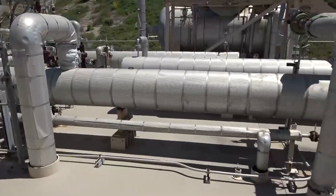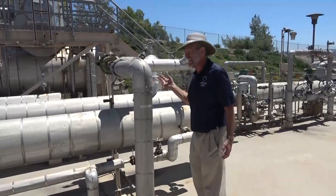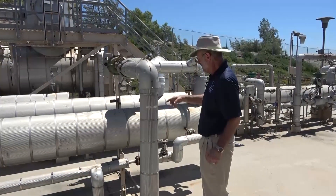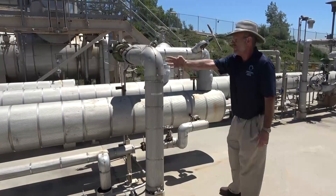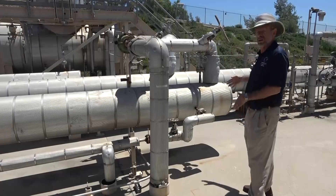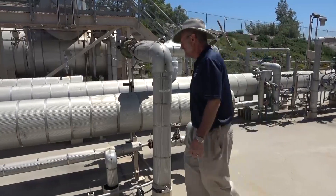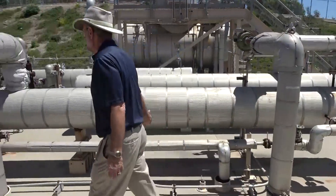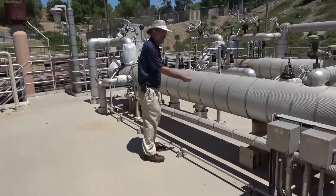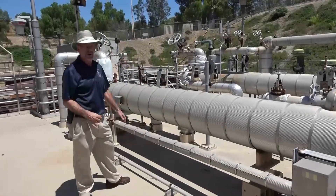There's another line that comes into the steam space — this is the drain that cascades backwards from the next highest pressure feed water heater, which is heater number one. The high pressure drain from number one comes in and mixes with the steam. Keep in mind the steam is already beginning to condense. The drain from number one is also two-phase, so we have this two-phase mixture at the same pressure. As that steam condenses moving through the bottom of the feed water heater, at some point it will be completely saturated, and then the last section is what we call the drain cooling zone.